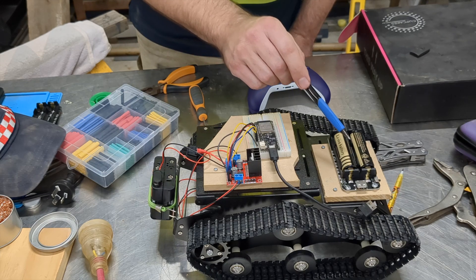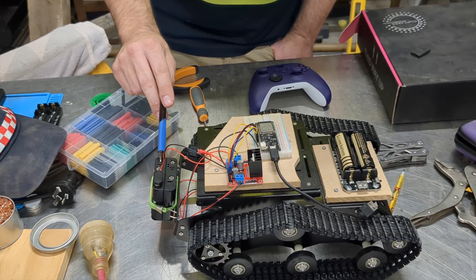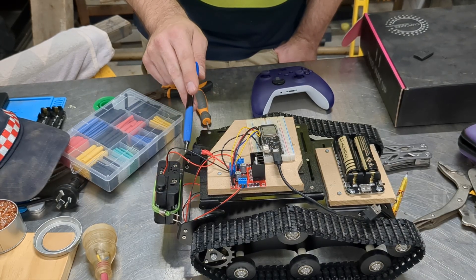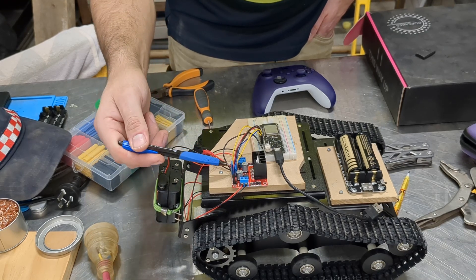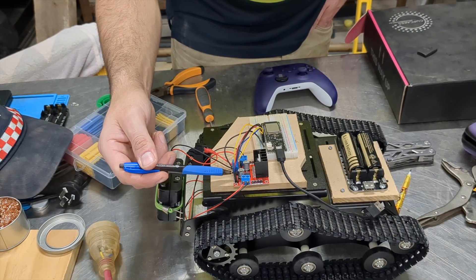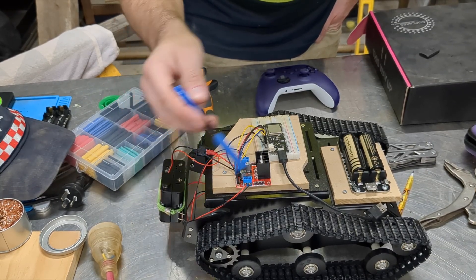This is the battery pack for the motors. The ESP32 side is all 5V, but the motors are 12V DC, so I can't use 5V to power them. I have a battery holder with eight double-A Duracells in series, which combined gives you 12V — enough for the motors. Coming out of here we go through a switch, which is easier than unplugging the stiff connectors. The 12V goes into the L298N, and then on the sides you have two leads for the right motor and two leads for the left motor. The jumper leads going back to the ESP32 allow it to control the signals — telling the motors to be on or off and controlling direction.